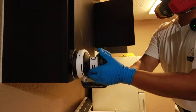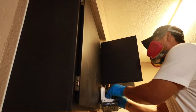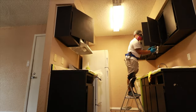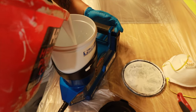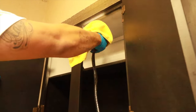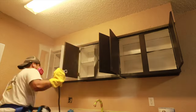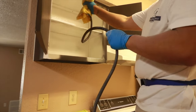After cleaning out the cabinets, we swept them out, wiped them with degreaser and cleaner inside and out, and then started to sand using a 120 grit with a little cheap sander. Once we started painting, we're using the Graco Quick Shot, which is the newest Graco. I'll put a link in the description — it's probably my new favorite sprayer for cabinets. It's tiny, compact, and easy to carry around into apartments for little jobs. It is a little pricey, so it's more for professionals, but it's definitely worth it.